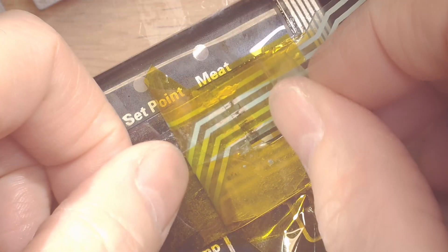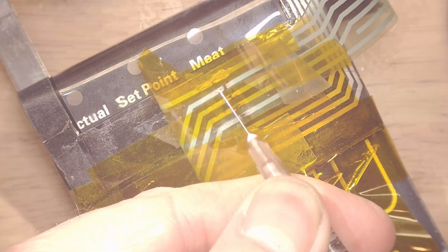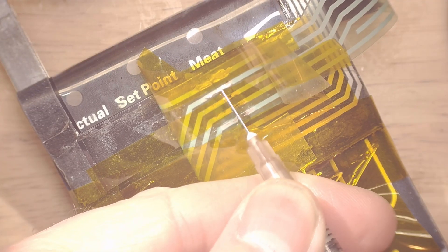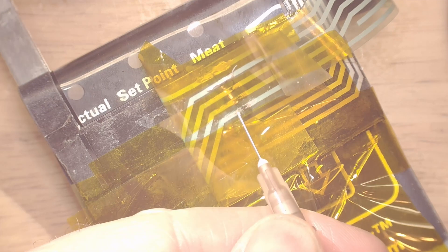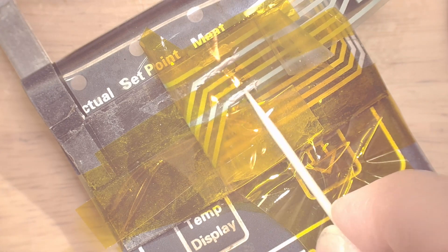The first trace turned out pretty good. I'm just a little bit worried about that bend covering the separation there in the trace. With the Kapton tape I've got it where I can do two traces at once, because it does take this stuff a while to dry. I'm coming back and putting on the other two traces after 10 hours, and the top one still wasn't fully cured — probably best to wait over 24 hours. You have to press really hard, but I am getting better at it as I try to rest my hand and keep it steady while pushing really hard to expel the trace repair glue. I'm going to remove the tape and I believe I can go ahead and do these two — I've gotten my confidence up.